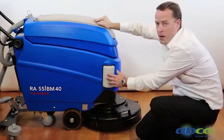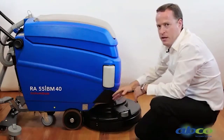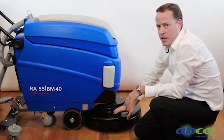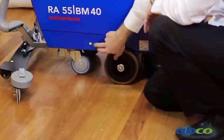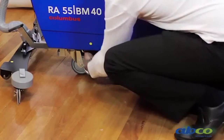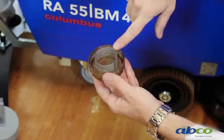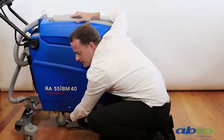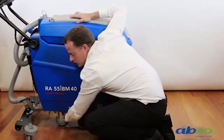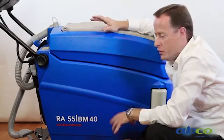You'll notice on this machine we have what we call bump rollers — on the front of the body, on the brush deck, and as well as on our squeegee. Any contact the machine may have coming up against a wall or your skirting boards will be protected by the bump rollers. The other service point on this machine is our water filter — that's the filter that filters all your clean water. It can be easily unscrewed and removed. We've just got a little gauze filter here which can be rinsed out under a tap, cleaned, and then put back into position. As we screw this back on, there is a little O-ring seal on the device that the filter screws on — make sure that is in position, otherwise it will continue to leak water. This is a service item that would be serviced when we service the machine; however, if you notice you're not getting enough water on the floor, this is somewhere that you can check.